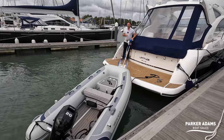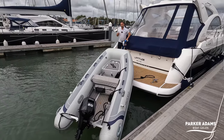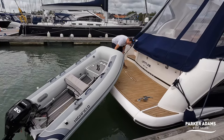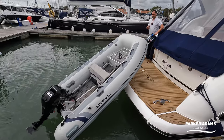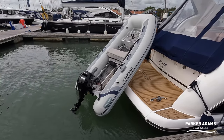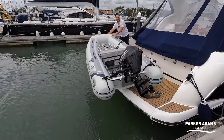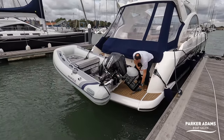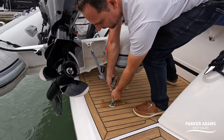I keep pressing the button. I'll stop it for a second just to make sure everything's aligned. The only thing I haven't done is pull my bowline out of the way, so I'll just do that now — it seems to have got stuck just on the back, I'll deal with that a bit later. I continue winching the tender up. When I get to this point I can, with one hand, just twist the tender into position. The tender is now on the back of the boat — it literally is as simple as that. I then get these clips, latch them onto the bathing platform and the back of the boat, and ratchet them down, making sure that keyhole is nice and tight.